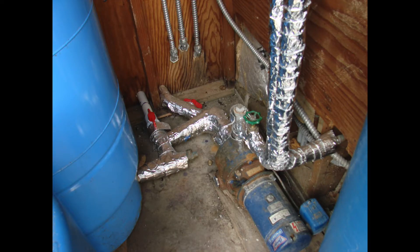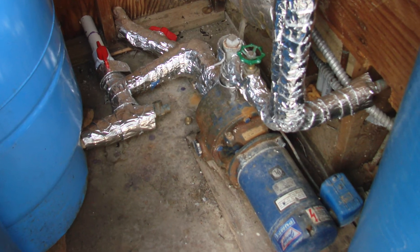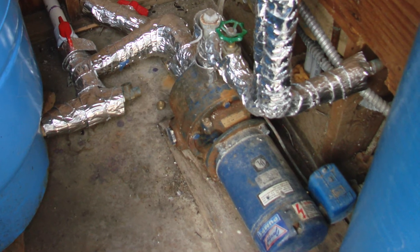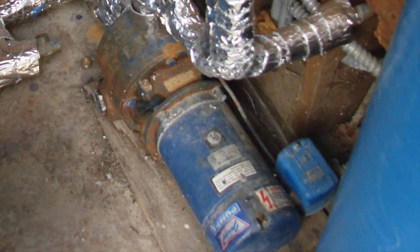The correction for this mistake, as seen in another pump house, is a pump that has been connected properly with flex that's protecting the wire. In this case, the pressure switch is mounted right onto the pump, and that works just fine too, but the point is we want to protect the wiring.